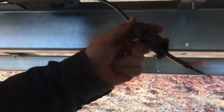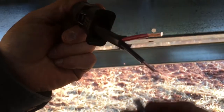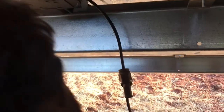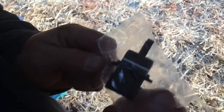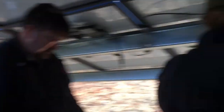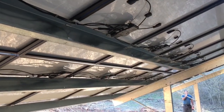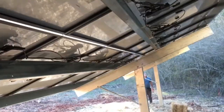Would you like to show these guys some of the Q connectors? These are Q connectors — this is the female connector that we're going to crimp on, and Abraham's working on the male. You can just make jumpers and stuff out of this — it's basically a tray cable, and Enphase's proprietary connectors are high dollar, but it's better than PVC. What I can't get over is just how busy it gets underneath one of these arrays. But it's all AC, and if anything gets cut it's going to turn off immediately — it's got rapid shutdown.